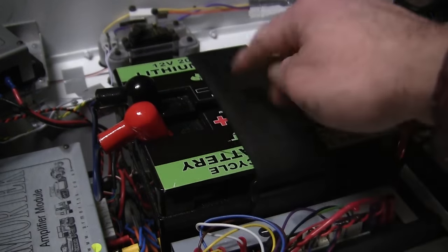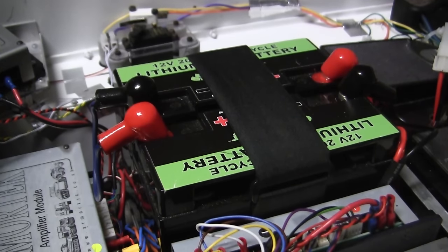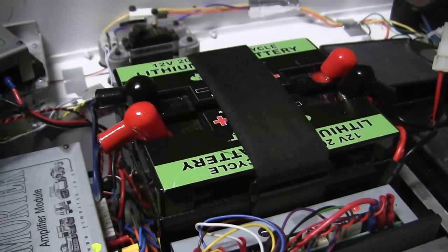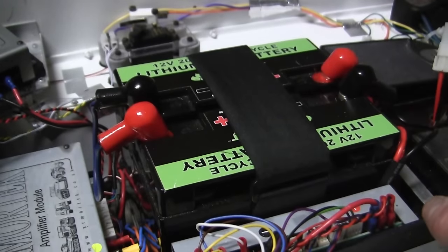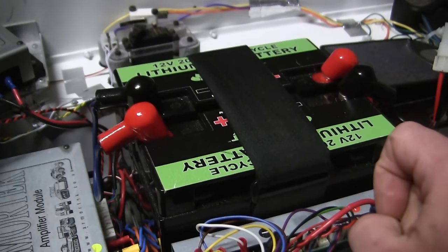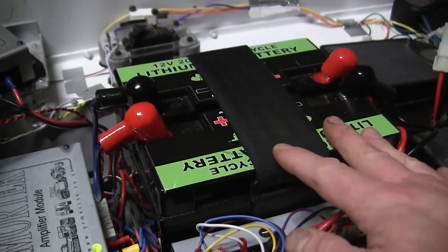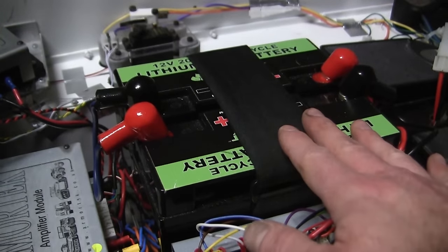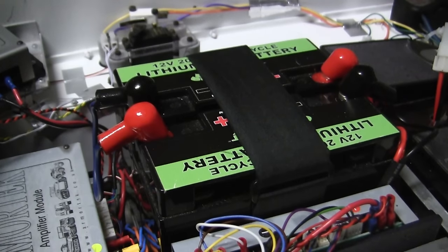These polymer cover caps insulate the terminals and are a great asset as they protect the model from any type of accidental discharge which can possibly happen during the tank's construction. Since a lot of the parts on the tank are metal, it is very easy to accidentally bridge and make contact with the pieces, which can have detrimental results from either shorting out the batteries or even some of the expensive electronics in this tank. The caps themselves are a simple drop and install, and with them in place, they greatly reduce the risk of any type of short circuits as well as give a lot more aesthetics to the interior.